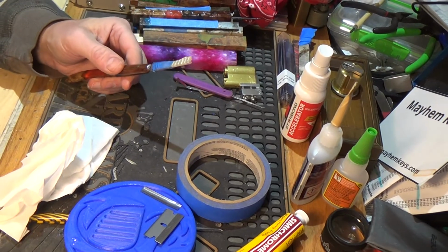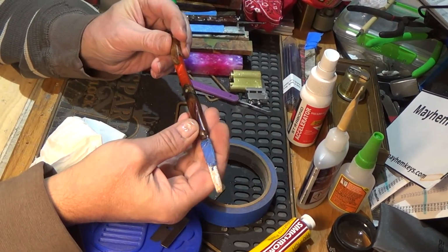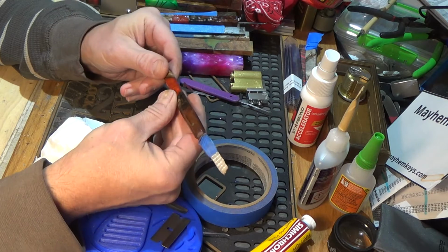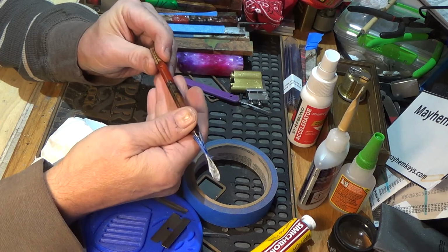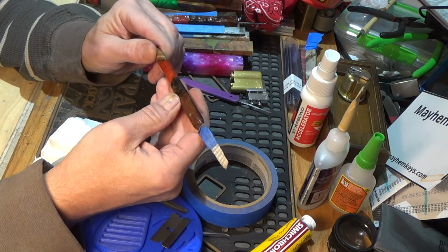And we're back after everything has finally been done. Hit it with 800 grit sandpaper, rinsed it with denatured alcohol to get all the dust particles off. Make sure that it was clean, and then sprayed it with lacquer. That will help things set and hold the integrity of the wood so water can't get in and penetrate it.